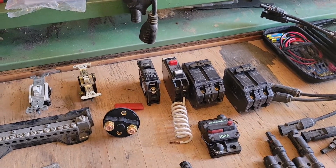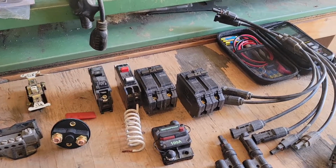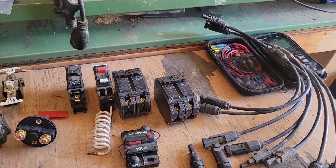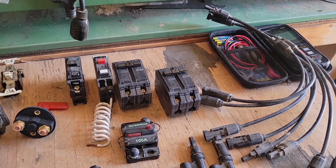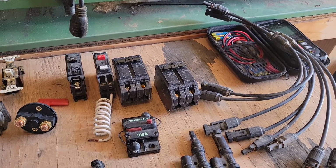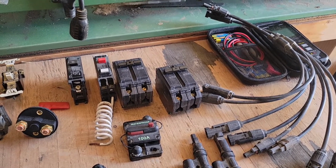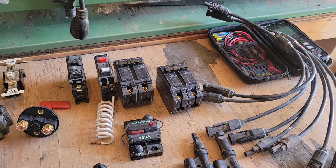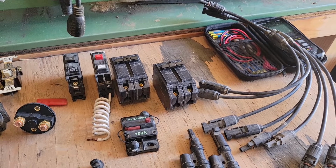And mine is a 1850 watt turbine. It's a KT5 from Thermodyne. The 1850 watts coming out of that I will never see, because it would take 90-mile-per-hour winds for me to see that. That's its max rating. That's as fast as it will go. Now, it would have to be a 100-mile-an-hour wind or even a 95-mile-an-hour wind to cause that turbine any damage just normally running. So why in the world would I want to put a brake on it?